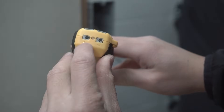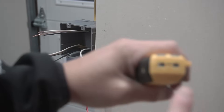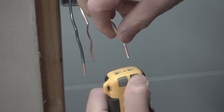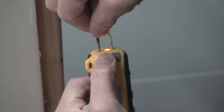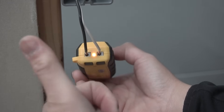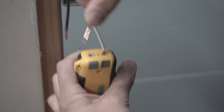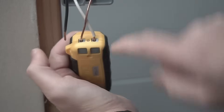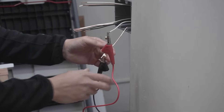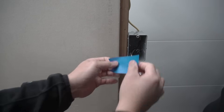If you look at the bottom of the probe, there's a positive and a negative. The red clip always goes to the positive. The red is connected to the white wire, so the white has to go to the positive side of the probe. Black connects to black, going to the negative port. You don't even have to turn on the probe — right when you connect those two wires, if it's the right pair, this thing will light up to confirm continuity. If you swap in the ground wire instead, notice how it doesn't light up. Moving the black clip to the ground wire makes it light up again. I'll label this group number one.